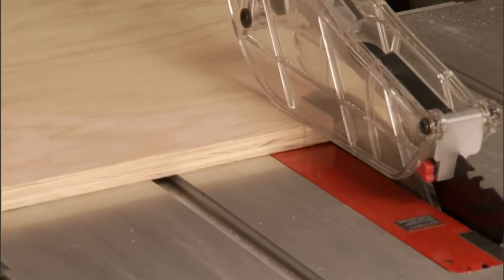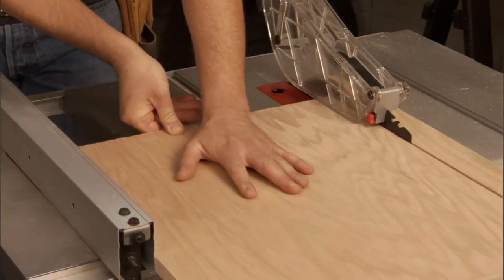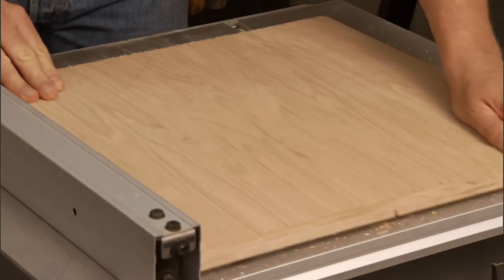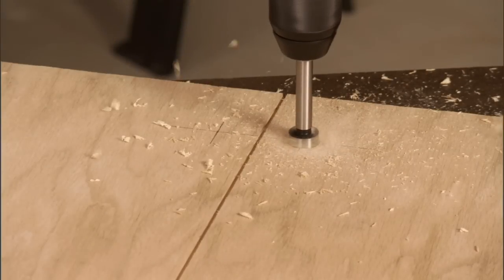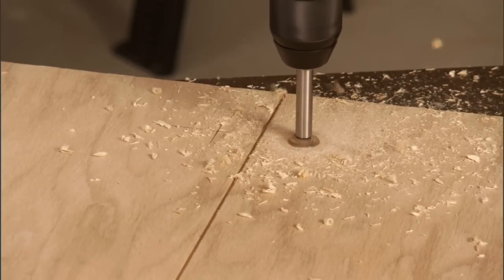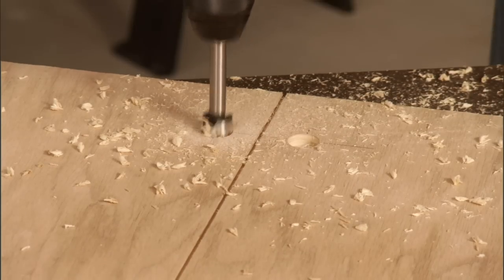Finally, the doors. Cut the three matching door panels on the table saw, and then we're going to add decorative grooves to really spruce up the front of our entertainment center. One of the doors will have a centered vertical groove, and two of them will have centered horizontal grooves. Now we have to drill the holes for our door pulls. I'll use these little cup pulls, so I'll use a 3/4-inch drill bit and drill 3/8 of an inch into the face of the door — just be careful not to drill all the way through. And there we go, perfect holes for our door pulls.